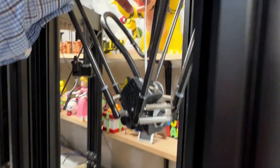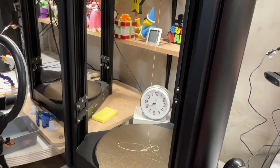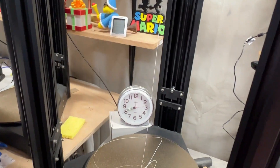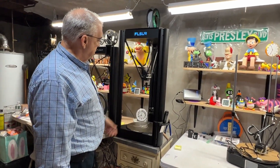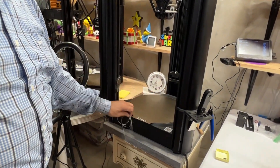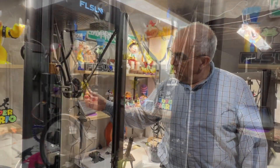You can see it's going in — look at my finger, you can see it going in there and coming out the bottom. I had yellow in there previously, so hit that button again to load one more time. Now it's coming out all white. Just let that finish up — it'll take a couple of seconds. You'll see it getting thinner, which means it's all done, but it's still going to drool — that's normal.